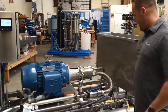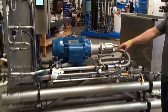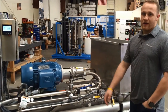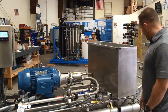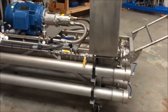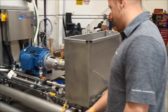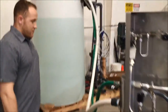It comes out on your high pressure side and goes through this eight-vessel RO in series. We can orient these valves to run either all eight or a single vessel based on how much volume you have to process. Over here we have our permeate header where all these tubes are basically collecting all the water that's dewatered out of the juice, and out of the front you get your highly concentrated, higher sugar content product.